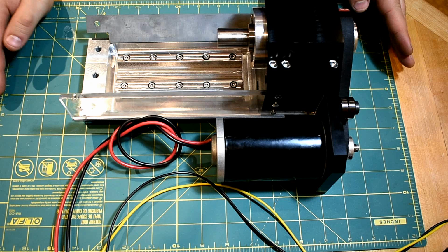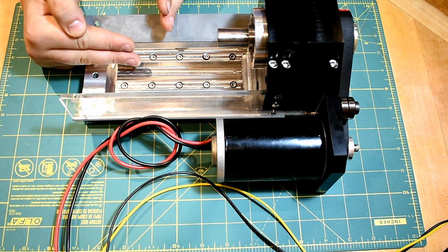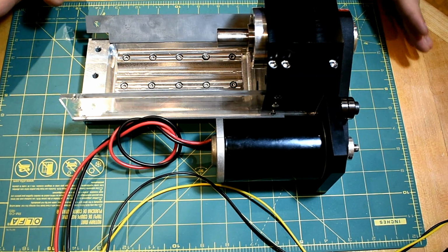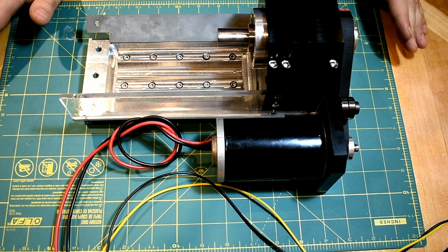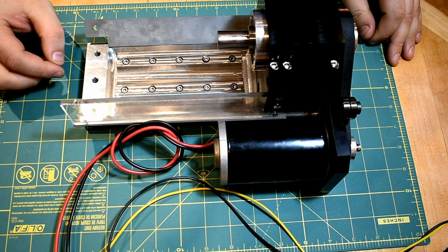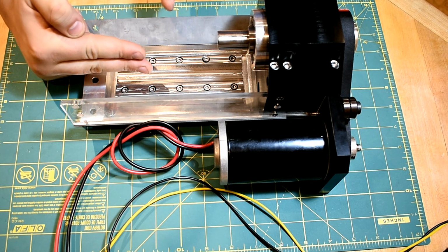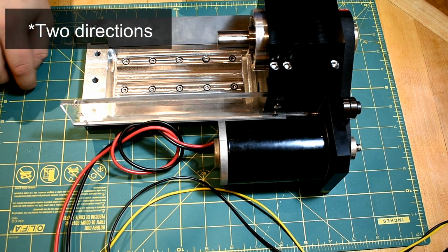So a normal lathe works in Z and X coordinates, and that makes it really hard to do complex curves and things. The idea behind this lathe is it's going to be almost like a freestyle, artistic kind of lathe. So if you want to make a pen or jewelry or pipe stems, things like that, and those are things I've made in the past just for gifts, it's really hard to do that with perpendicular coordinate systems. If you imagine moving in X and then moving in Z and then moving in X, you get a lot of Etch-A-Sketchy marks, and that's kind of the root of the problem. If you think like an Etch-A-Sketch, if you only move in two dimensions, it's really hard to do curves.